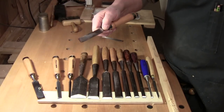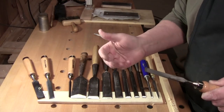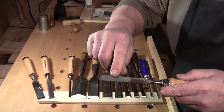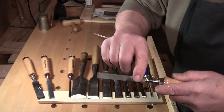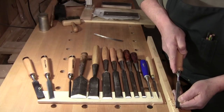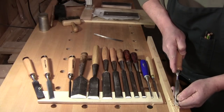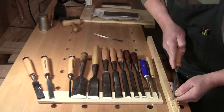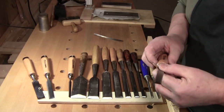As far as these chisels are concerned, they're not bad. People say they're mild steel, but I say no — they're tool steel, heat treated to an acceptable level. As long as you've got a hollow back — concave back — connecting at the front edge, that's all you need. They're a good entry-level chisel, and I'd venture to say you could put these in the toolbox of any craftsman who knows how to use a chisel. The worst thing that can happen is you might have to strop or sharpen a little more often with these.